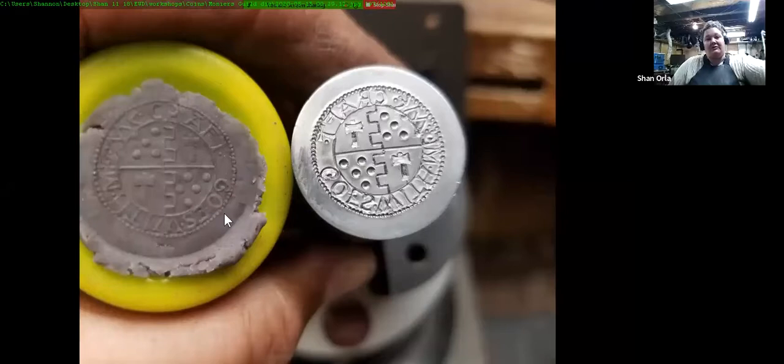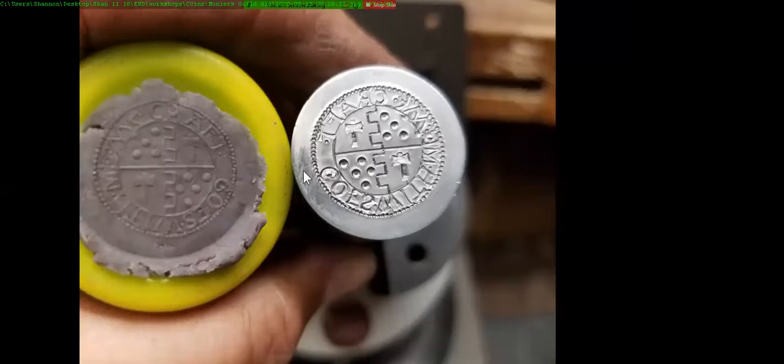I made the hammers a bit deeper. Then I am going to sand this — sanding the material that is displaced when I use the punches. I continue to sand until I have my relief flat.